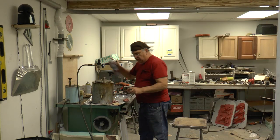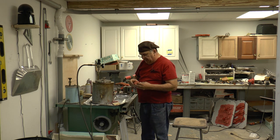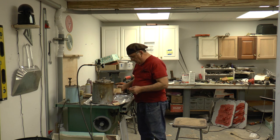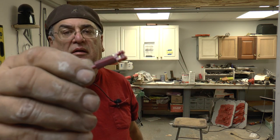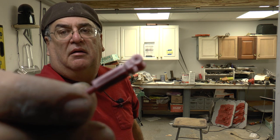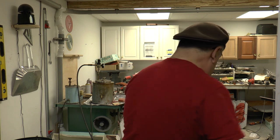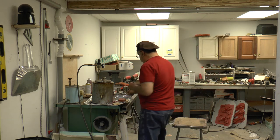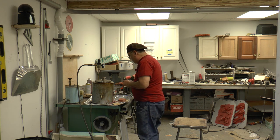All right. I made a mold. I mean, I made a wax, and not too bad. I mean, the mold is kind of messed up, but I made a good wax. Where is it? It's right here. Here we are. Pretty good, I think. Usable. Definitely usable. You have to kind of take the parting line off a little bit, which is wait till it gets harder and then you do it.